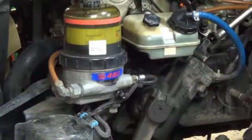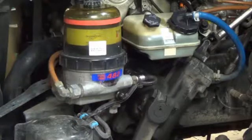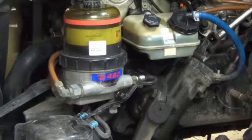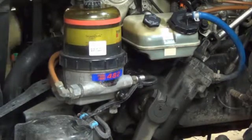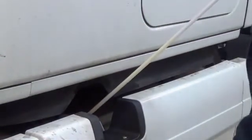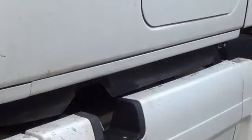We are now going to start the engine. Now we are going to pull the pickup tube out of the fuel tank. Point the nipple up — you can see the fuel level in the tube. Just push the nipple in with your finger, allowing the tube to drain. Then place it back on the machine.